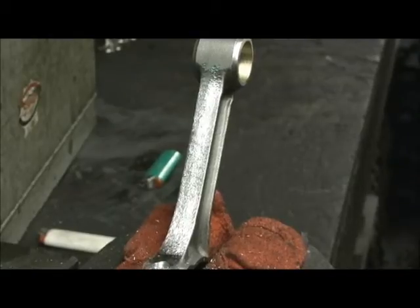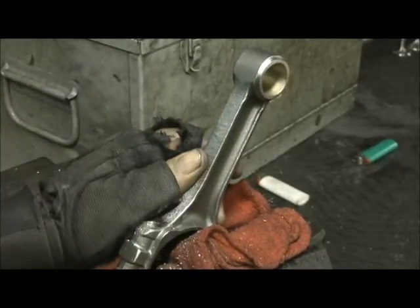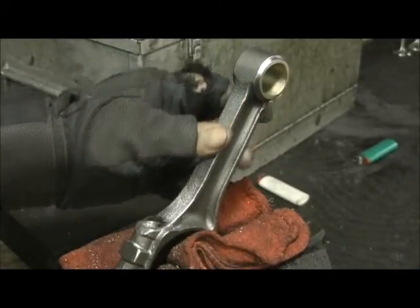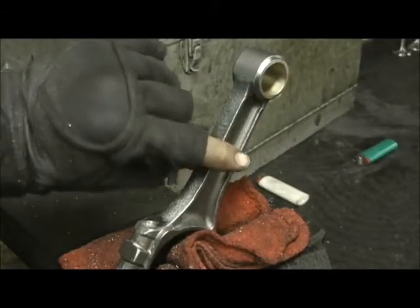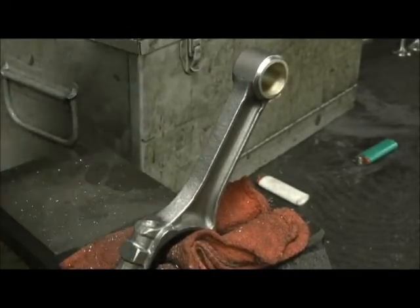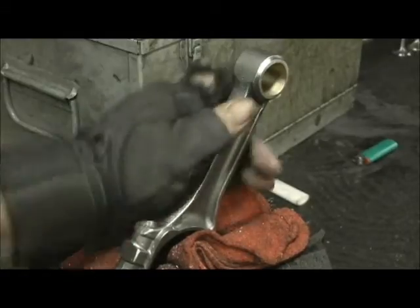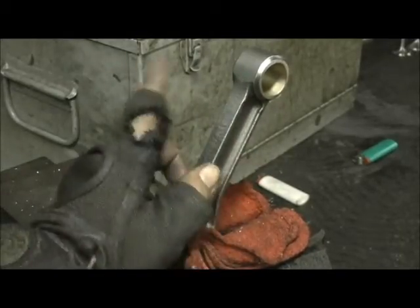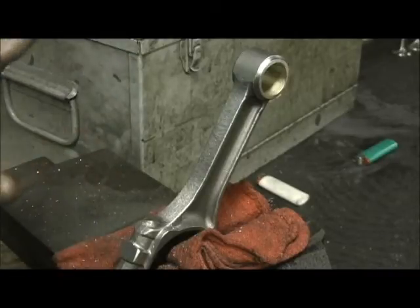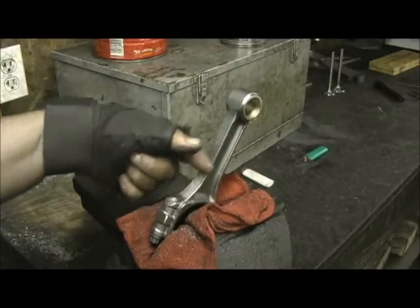She's finished. If there were any hairline fractures — which is the problem from the center of the forging dies where the two are smashed and the excess splits out — I'd have ground it level with the rest of the stuff without rolling off the edges. Now I'll go with the stone and step up my grits: 50 to 120 to 220 to 400, then 600 polish, from here to here like a mirror. One thing to remember: you can't go against the grain, you can't go side to side. I see a lot of people take orbital discs trying to save trouble — wrong. You have to use the grinder and go in an upward and downward motion. You've got to go with the grain.